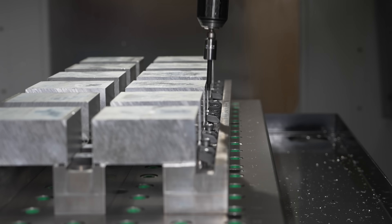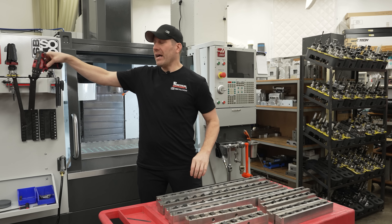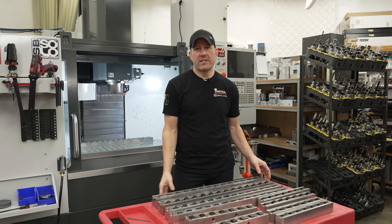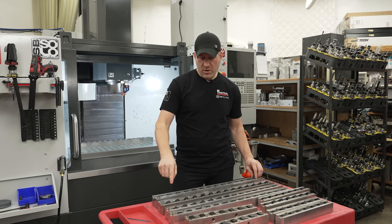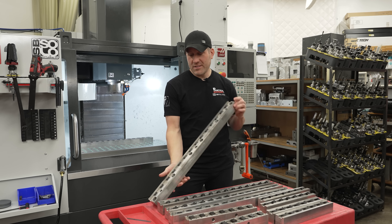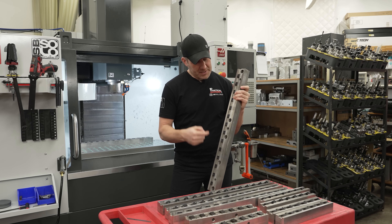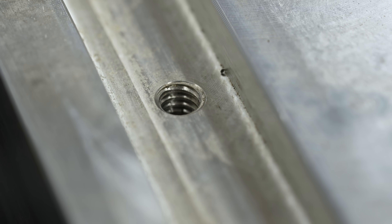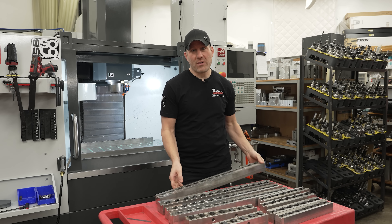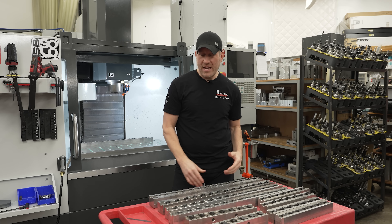These ones are actually quarter inch, so I just put it on number 16 right here and lock those down. I do come back with an Allen key by hand just to make sure that I hit every one of them, because I've run out of attention and basically forgot to lock one of them down, and ran it over and blew up my end mill. So that's the only time I've ever ruined a thread. I've run this particular clamp probably for a good 10 years on thousands of pieces and I'm still on aluminum threads. I don't have them helicoiled, I'm just using your standard form thread.